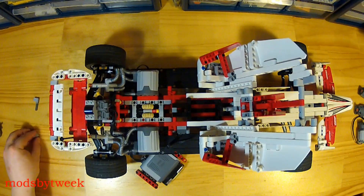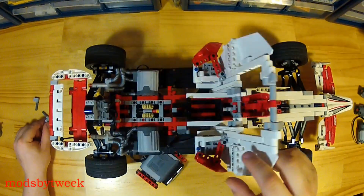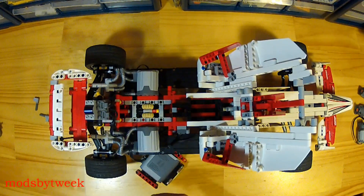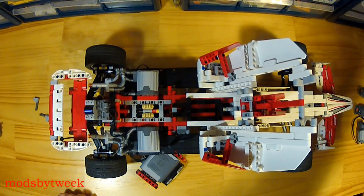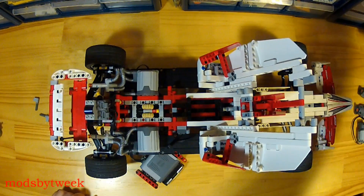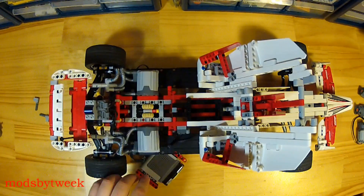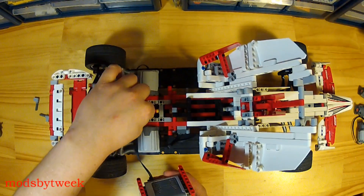I use one of these with a flat head on the end just to pull out so it can move up and down. For the motor shaft, I like to take the shaft all the way up here — it just seems to stiffen everything up. I put one of these smooth pieces right in between, which seems to hold the gears in place better. These just pop on with a little standoff right there, and that was to give enough space for the battery. For the battery I had to add a little standoff just so it wasn't hitting these gears.